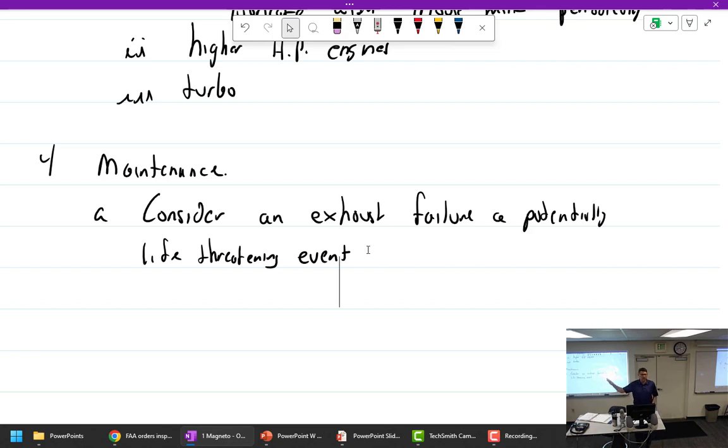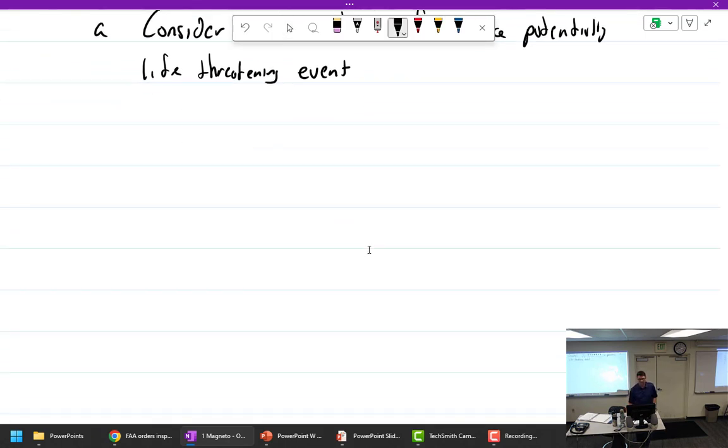Well, now you've got exhaust coming out that much further up than it used to. And then it's going to be near the cabin, and it'll go up the steering rod boots or some other thing, get into little nooks and crannies in the aircraft and give you carbon monoxide poisoning, which is very, very bad. Aside from the carbon monoxide poisoning, what was the other reason? Fire, okay. Let's put that: CO poisoning and fire.